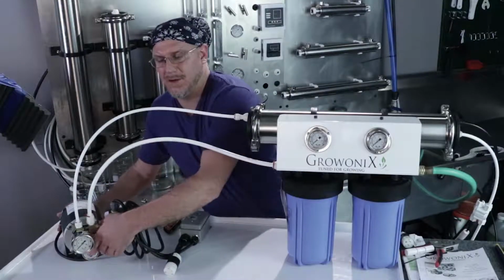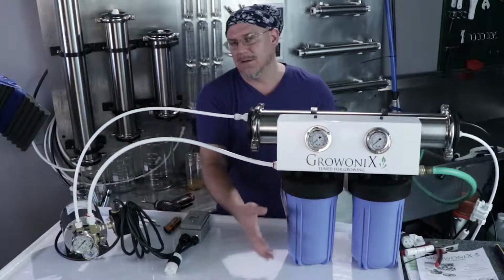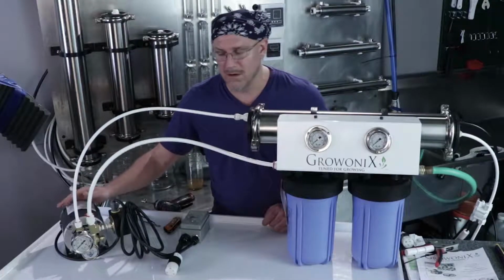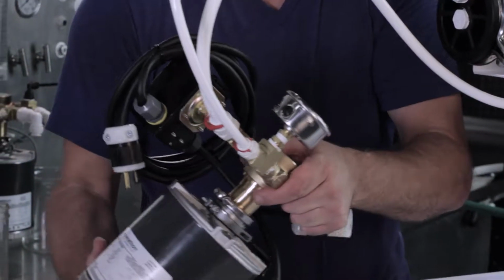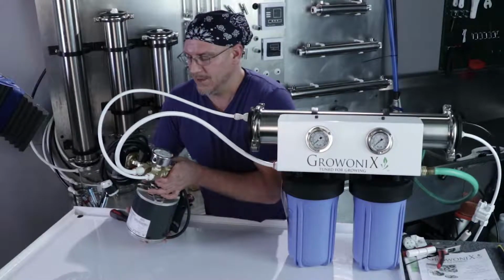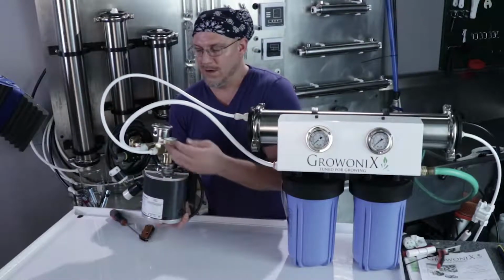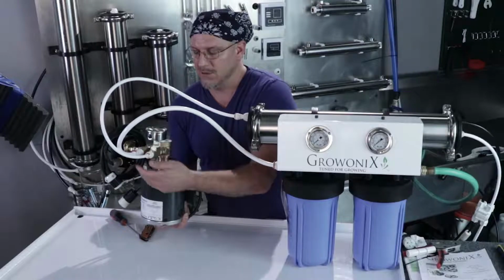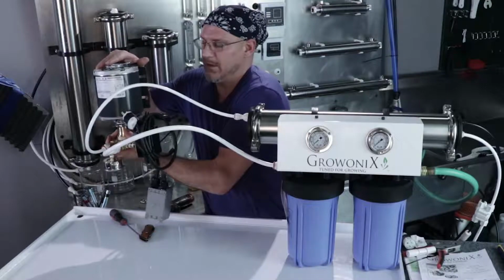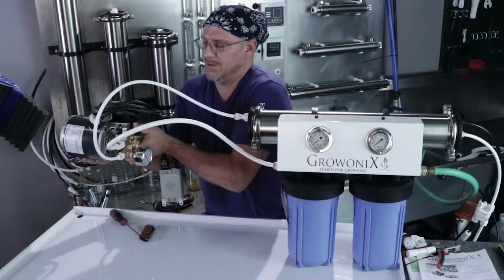Now when you mount a 6010 pump, you generally want to mount it on the wall. You want to mount it above the RO membrane, not down here where a leak is going to leak on a pump, because it's 120 volt AC mains. You don't want water on it. When you mount it to a wall, and we're going to show you later, you can reference the video, the EX1000 Deluxe installation and setup, and you'll see us mounting an aluminum panel. But you don't want to mount the pump like this, where if you had a leak up here in the water section would drip on the motor. You want to mount it sideways or even upside down, so that any water will drip down and not on the electrical. Sideways is one of my favorites, with the adjustment nut on top.